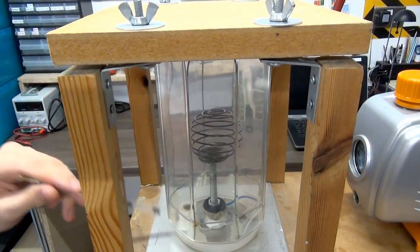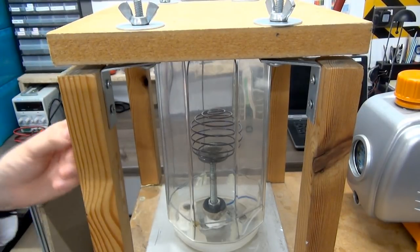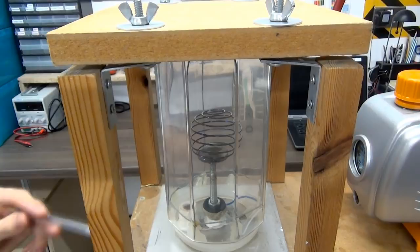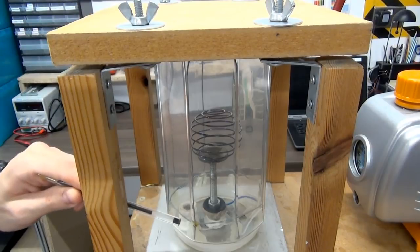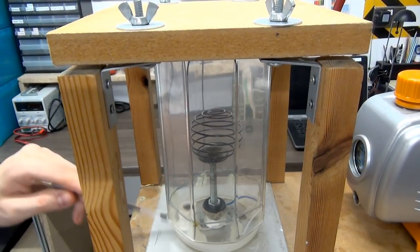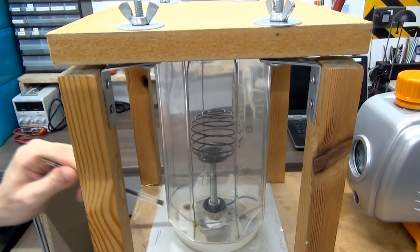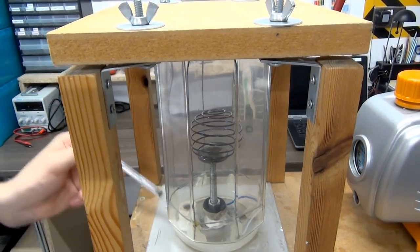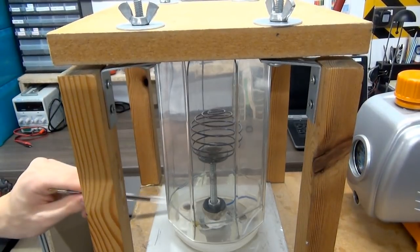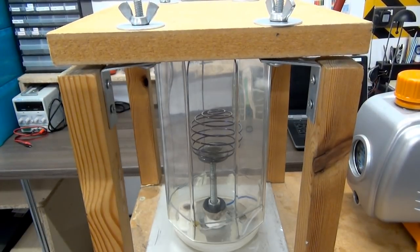I tried all sorts of methods, I tried all sorts of contacts and connections, and every single time there was a leak. I tried a million and one different types of glues and sealants and liquid cements, but it turns out the solution was these two gland/grommet type plastic systems for running cables into and out of cabinets. I just put some really tight rubber grommets and washers around the bolts and around the hose, and then stuffed them inside these plastic connectors and screwed them on really, really tight with a rubber washer that you can't see underneath the plastic, and that actually worked really well. But that was about the fifth iteration.